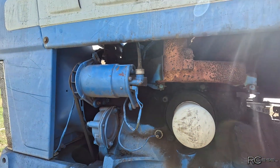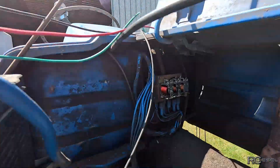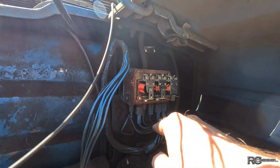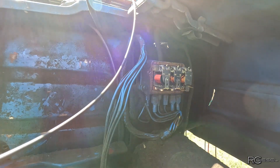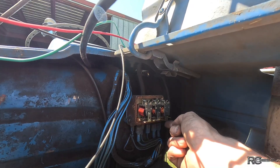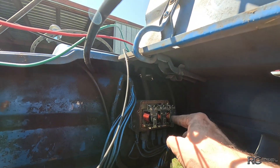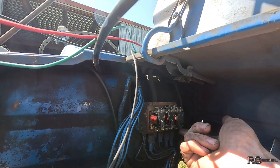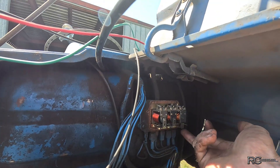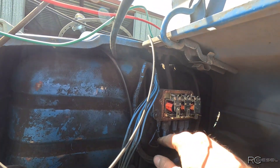Once the engine is shut down, it stops charging, and when you go to start it again it doesn't keep charging. So I went into the voltage regulator and did all the voltage checks — everything is working as it should, except the regulator is not giving power out on the field winding to the generator. This guy here is the cutout coil, and when you turn your key on and start the tractor, this contact is supposed to click into the on position, and it doesn't. There should be a secondary winding in there that pulls it in when the tractor first starts running, and that's not happening. After you shut the tractor off, the generator stops charging, the voltage drops below the threshold, and this contact is supposed to pop open again — and that part is working. But it's not being engaged when you start the tractor, even though I have power everywhere I'm supposed to.